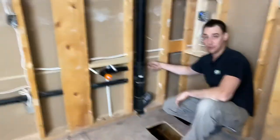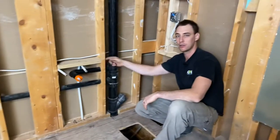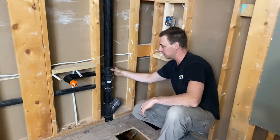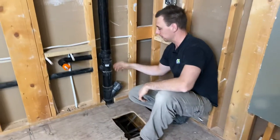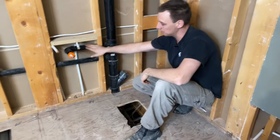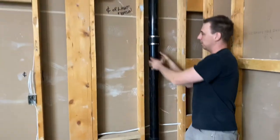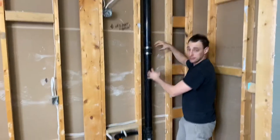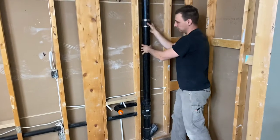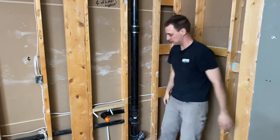Then I cut this as low as I could inside the wall without cutting the drywall behind it — it was a bit of a pain because they have a 2x4 wall strapped to three-quarters, so there's not a lot of space. Cutting with a Sawzall wasn't super easy, so I left just enough to glue a piece in to keep this as low as possible — it's at about 22 inches. I cut it up nice and high, put a fernco on, slid it up, moved things out of the way, dropped my 3-inch, and slid the fernco back down. It was quite simple and worked out pretty well.